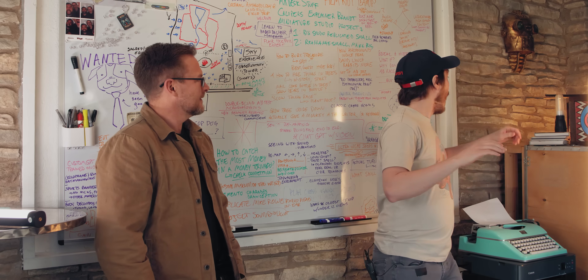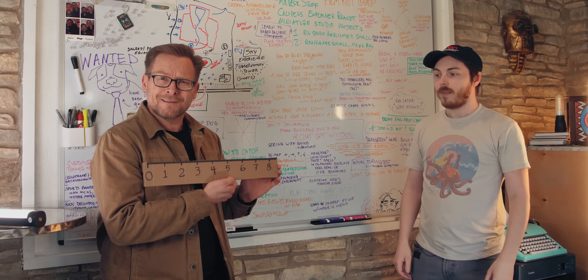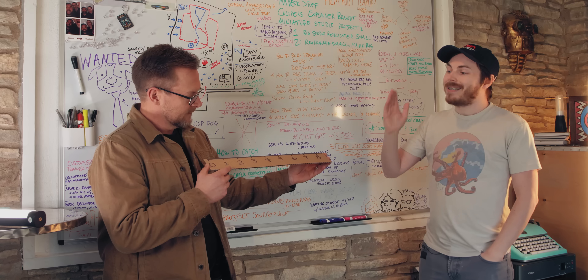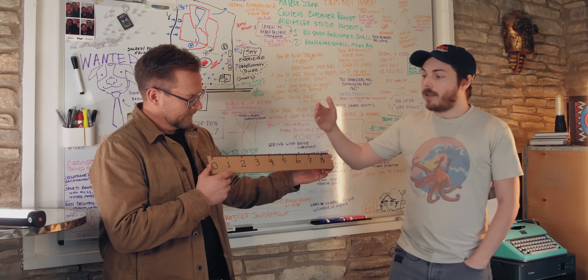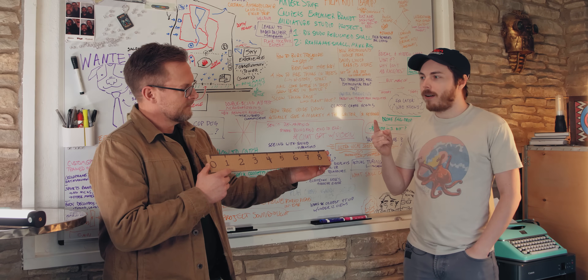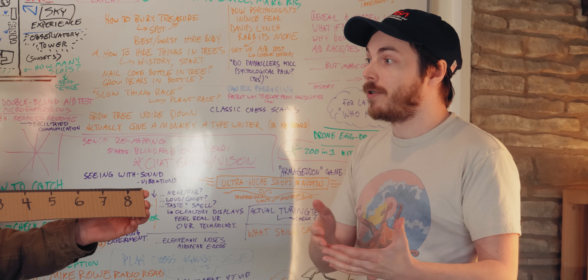Vernier calipers are analog calipers. It's so elegant and simple — it's just beautiful. I love it. You'll learn it so quickly. I made us some rulers. This is yours. Not to scale? It's to a 50-to-one scale, so imagine these are millimeters. Sometimes when you measure something, it'll land in between the millimeters, and it's really hard to figure out what tenth of a millimeter it's actually measuring to, especially if you have an application that needs that sort of precision.